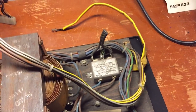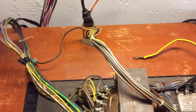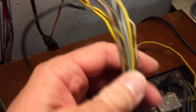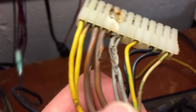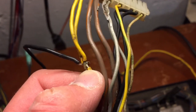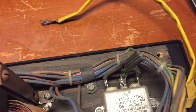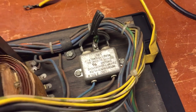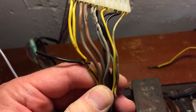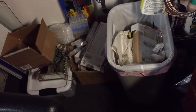We're going to get a new line cord and stick that on there — I repinned that connector of course. It looks like I should have plenty of room if I cut that down, because I've got to cut this down to here. I'd rather just get rid of all this because these wires are melted all the way down; this was spliced in and soldered. I might be able to work a little magic cutting some zip ties and freeing up where I'm tethered. Worse comes to worst, I have to extend these wires with some scrap wire — I actually have all the colors in my big box of scrap wire.